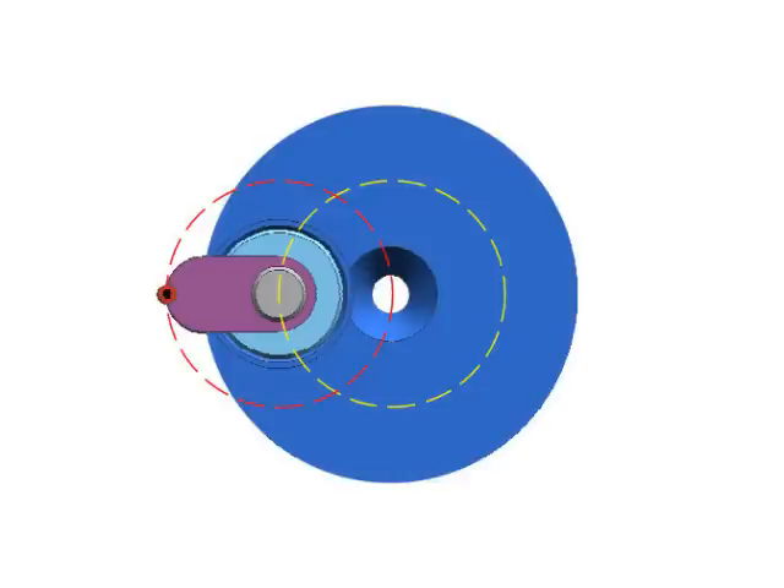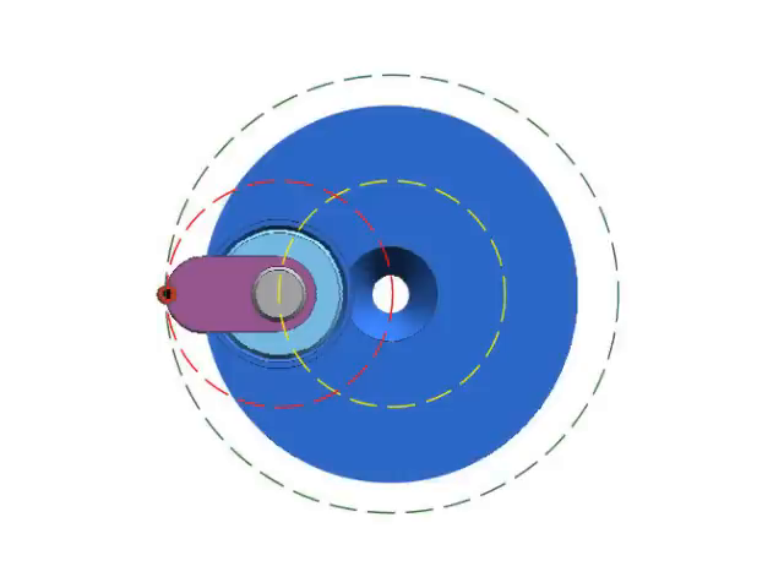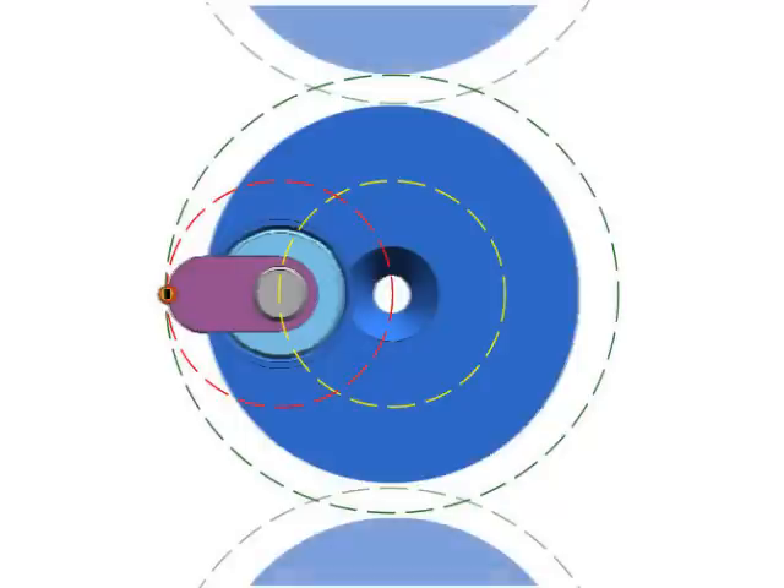The rotation of stage 2 is phi. As it rotates, it moves the fiber around the stage 2 axis. The combined motion gives 100% coverage of a 9.5 millimeter diameter patrol area. Because this is wider than the diameter of stage 1, it allows adjacent fibers to occupy overlapping positions in space to maximize the number of simultaneous observations that can be made.